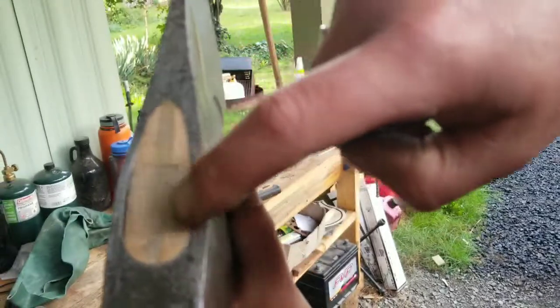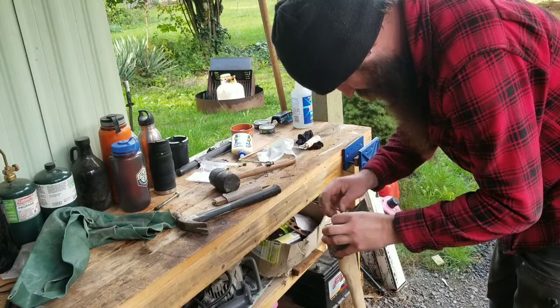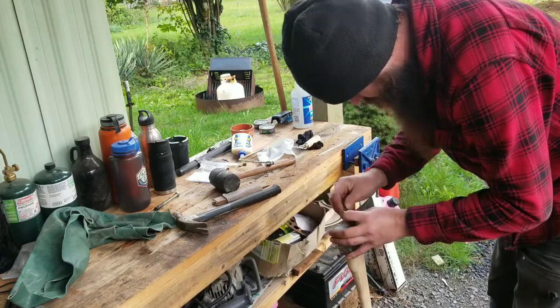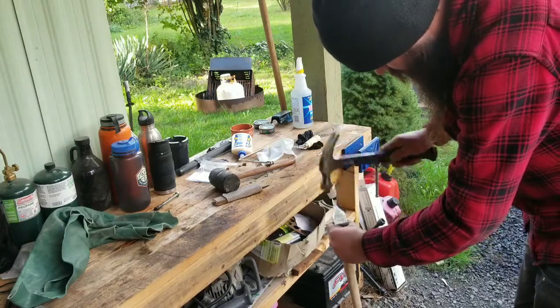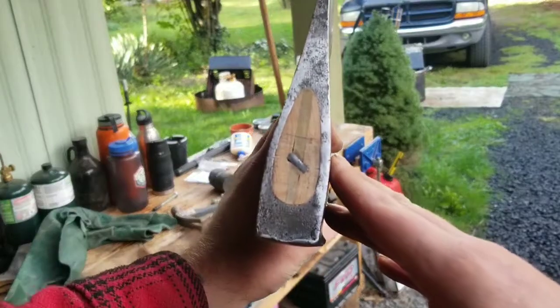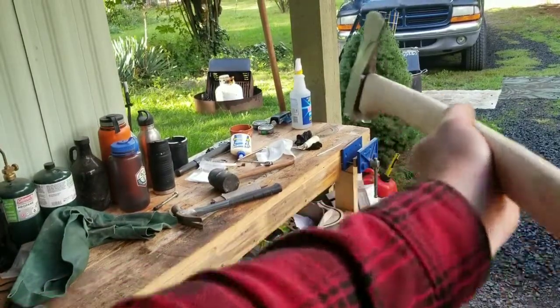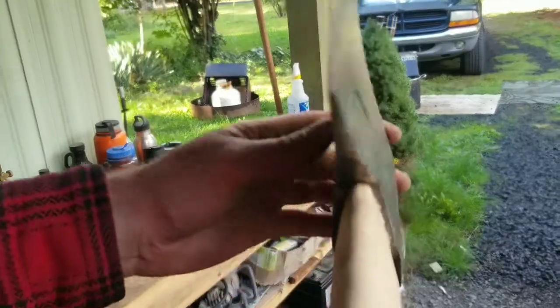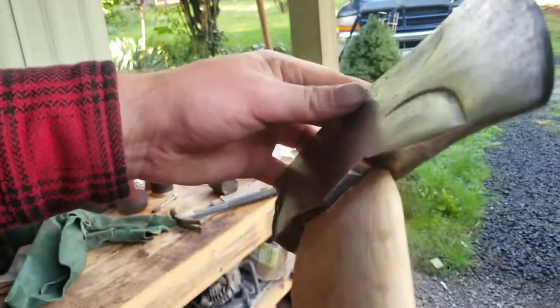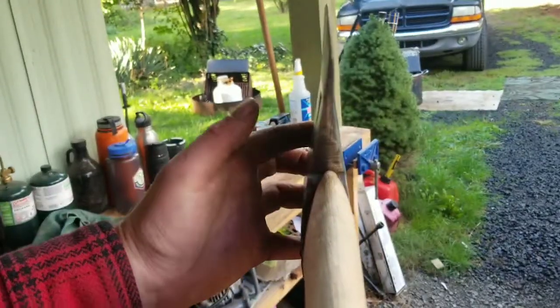There are gaps just very slightly there, so I'm going to go right in between with the step wedge. That worked out pretty well. Now if I can stop hitting the tripod — you can see how crooked that is. If you look closely you can see how poorly forged this axe is: see how thin it is right there, how thick it is right there. When you look at it head on, it's a lot thicker on one side.